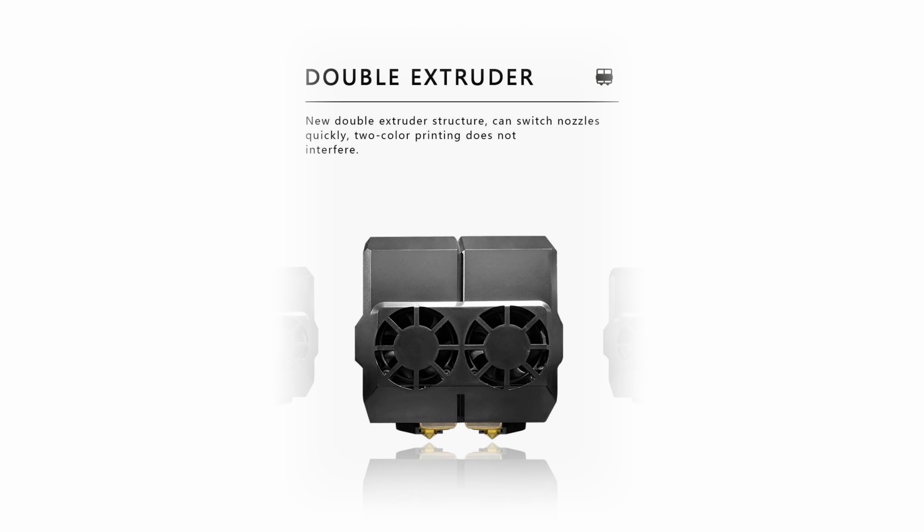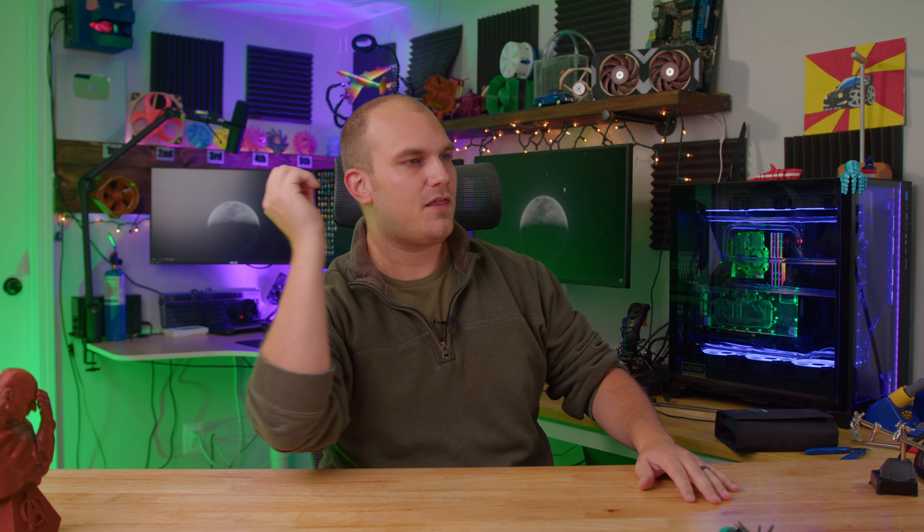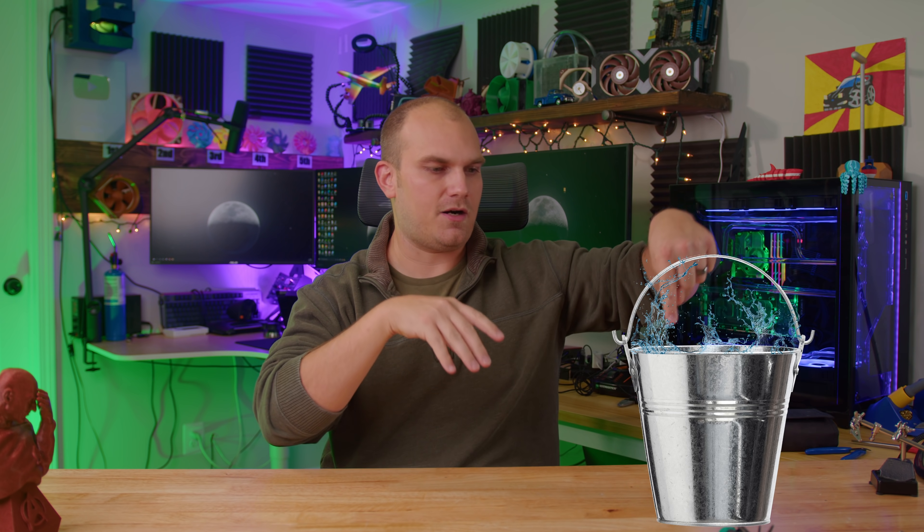QIDI isn't sponsoring this video — I just want to let you know that if you were thinking about designing a fan but weren't sure if I could print it, rest assured, because no matter what you come up with now, I can print it. The feature I'm most excited about is the dual extruder, because we can now print with PVA support material. PVA prints at a similar temperature to PLA and dissolves in water, so I can print out whatever crazy design you send me, throw it in a bucket of water, and the next day it's perfect. Bucket, water, magic.